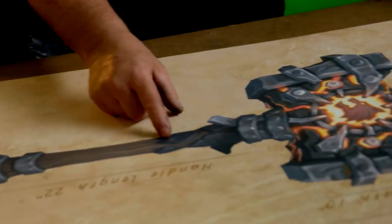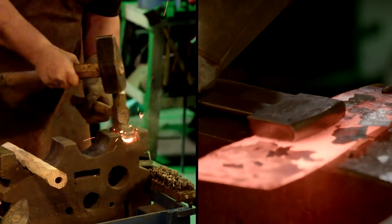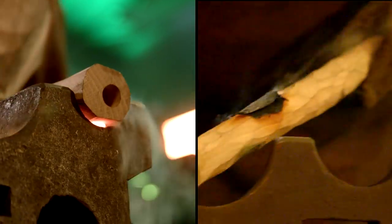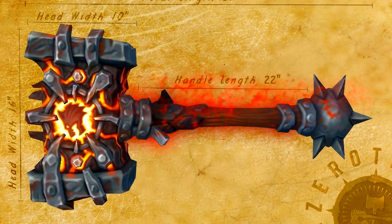There's a design element in the Doomhammer handle that shows these little patchy pieces of metal. I had a tool that will impart dragon scales on it, and then forming the metal to wrap around the side of the handle, burning it into place. I bring it to the layout table and stain it to give it the appearance of an aged, old oak handle. That will complete the construction of Doomhammer's handle.